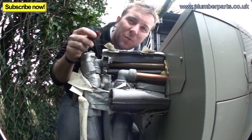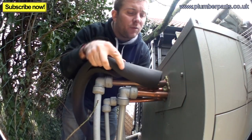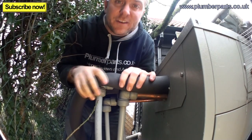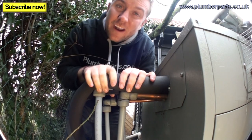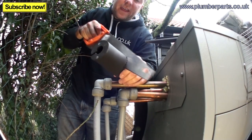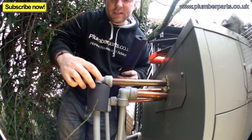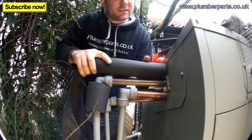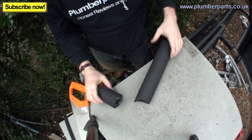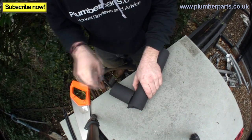So first up, safely with a knife, just cut away all the old insulation and clear up the pipe. Let's firstly have a look at this special joint called a miter joint — that is when you have a piece of pipe coming up here and a piece of pipe coming across, and you want to insulate those. Get yourself a small hacksaw or a small fine-bladed saw and cut your insulation. I always cut just a small piece that acts as a guide piece for how big you're going to be. Using this width, you know exactly how much to cut, so we're going to cut it nice and tight, then marry these pieces up together. Make sure you've got the slit on the side where you want it, then cut a diagonal down like so.